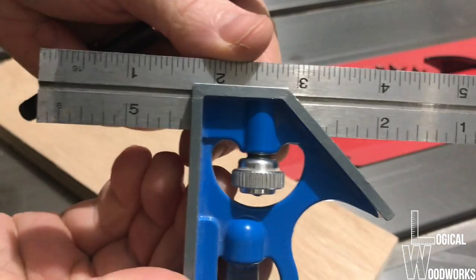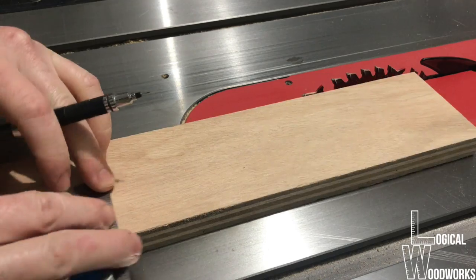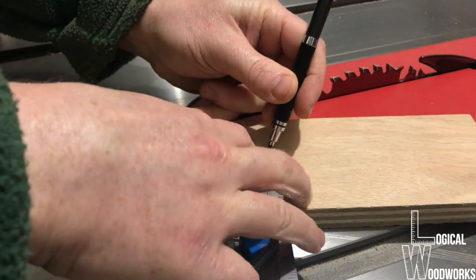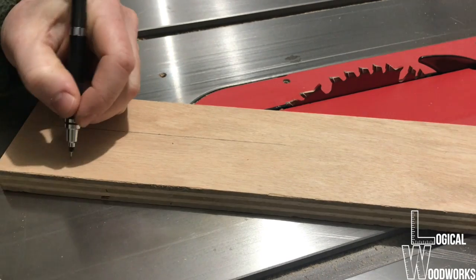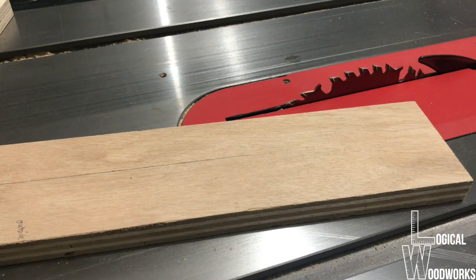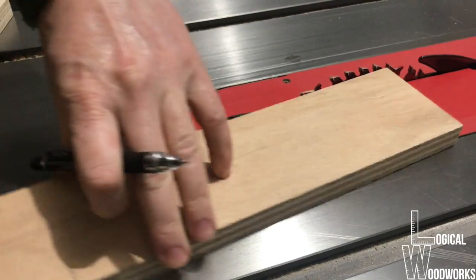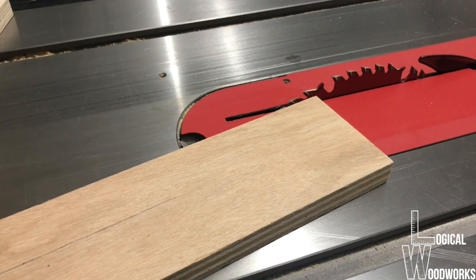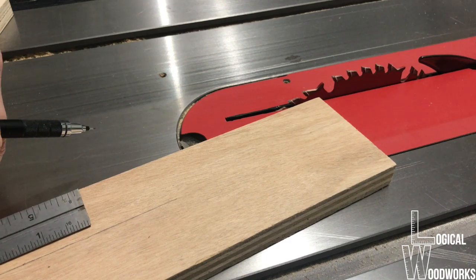One of the last steps was to get the adjustable shelves drilled. Using a piece of scrap plywood, I marked a 1 3/4 inch line from the edge. That would be directed to the outside of the case. From there, I made a gap of 2.5 inches between each hole. Finally, to finish the jig, I cut a piece of plywood that made a small lip on either side and attached that to the outside of the piece. That allowed it to be reversible.